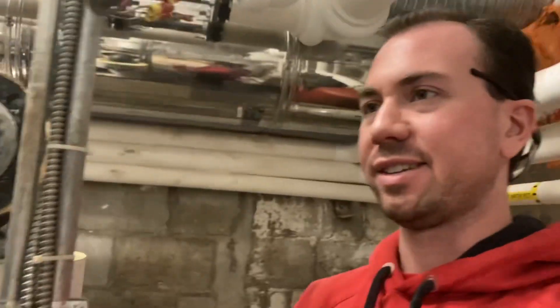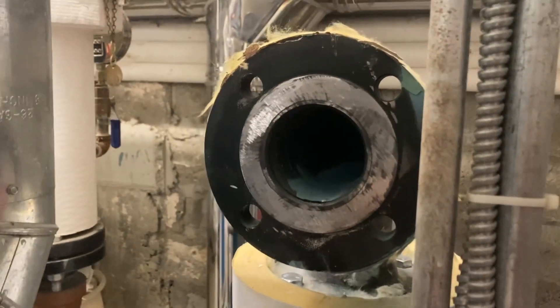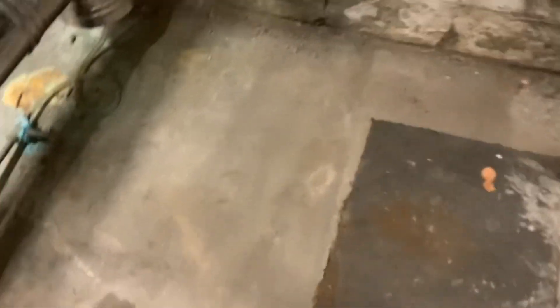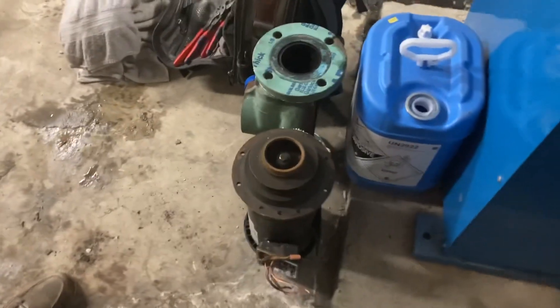Flanges are good and clean, so is the mechanical room. We're not going to sweep the whole mechanical room — neither is Ian — because we didn't make a mess, but we made it cleaner than when we got here. Flanges are prepped for the new pump. The new gaskets will probably be red rubber and we're going to goop up the face of the pump and the flange so that the gaskets come off easier next time it needs maintenance.